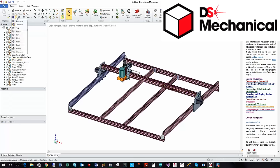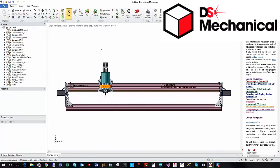That's the model — I just wanted to quickly show you what we're actually building. It's basically 1.5 meters across and 1.5 meters back. I'm using a Bosch Colt router for the main drilling head, and all of the steppers in my case are NEMA 23s. This model is still currently showing a NEMA 17 — I need to adjust this before I post the actual diagrams.